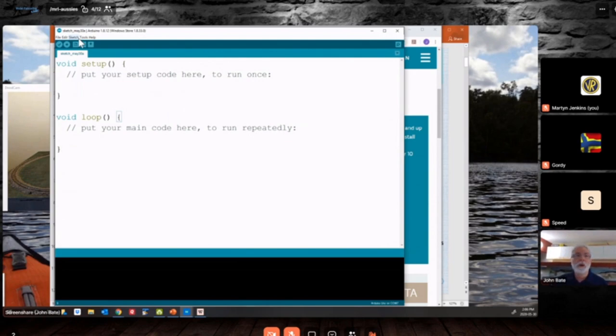So let me show you, from now on we're going to talk about the programming. There's the program that you will get almost if you just click file and new in this thing. If you go up to the file menu and say, give me a new program, this is what you will get. You'll get something that looks exactly like that. And what you see there are two things that are called either functions or methods. There's one called setup. There's one called loop. For now, that void setup and void loop, with the two parentheses after them that have nothing inside and the little curly braces that go around there, don't touch. That's the advanced class. Just leave them there. Don't touch them, and you won't have any problem. That's what we call magic for the moment.